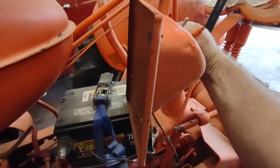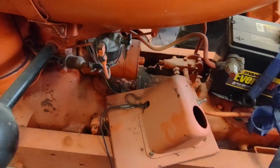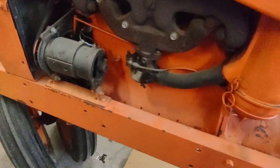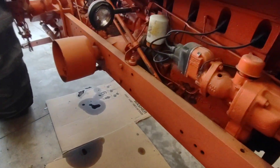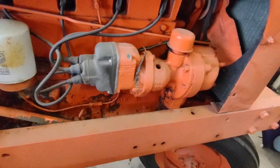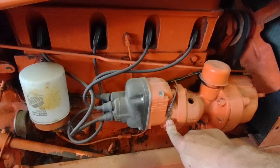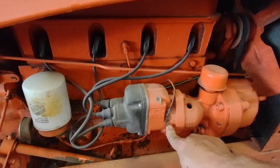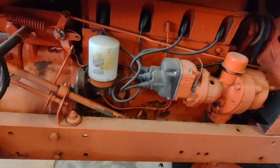This switch is actually a kill switch. This tractor does not have your typical coil and standard distributor — it has a magneto. The magneto does not need any electricity to fire up and run the tractor; it creates its own current. There's a kill switch — you ground it out and that kills the spark. There's a wire going from the kill switch to the dash piece, and when you flip that switch it grounds out the magneto, which kills the spark and lets the tractor die.